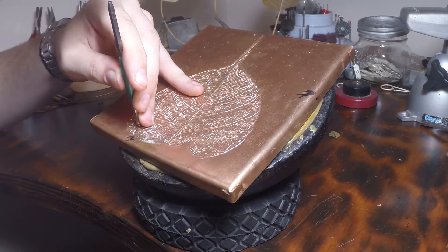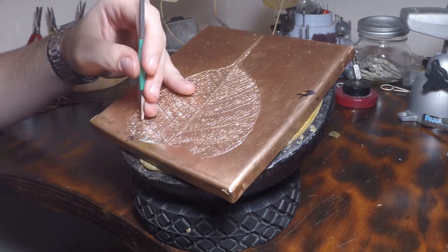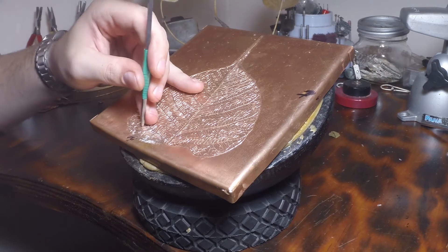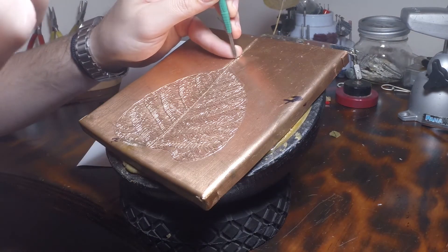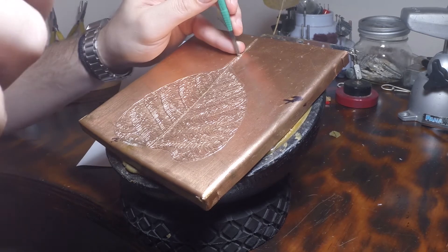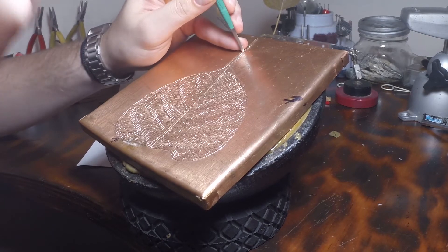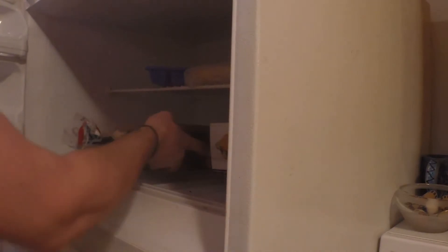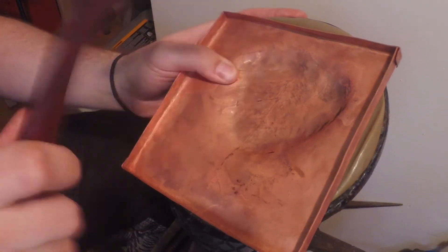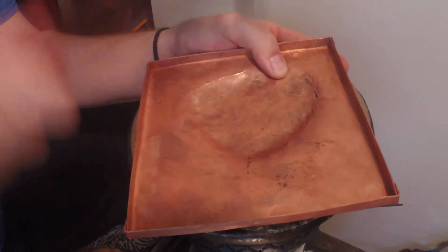With this new project and new pitch, we learned that if you put your pitch bowl and the project in the freezer, the project will actually disconnect from the pitch really easily. Instead of trying to heat up the project in the pitch — where you take it off and it's this goopy disgusting mess and you end up with excess that you have to burn away or use paint thinner to remove — this way it's just one quick tap on the side, you pull it off, and it's done.